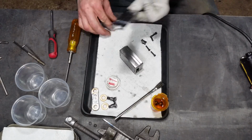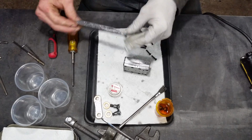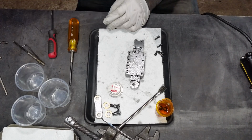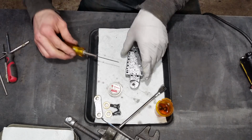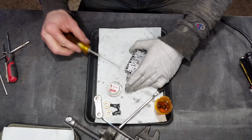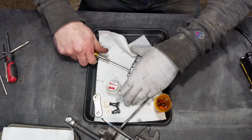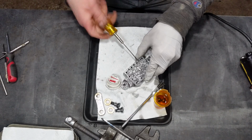There's probably better options than bar oil for lubrication here. I need to look into exactly how scraped ways work and what weights you need for different scraping patterns and things like that. But so far this has done a really nice job and doesn't seem to discolor, which means I'm not wearing too badly, and it really seems to do a nice job.